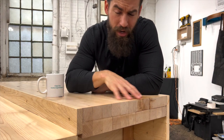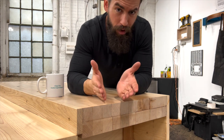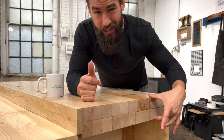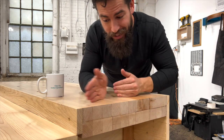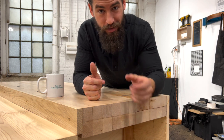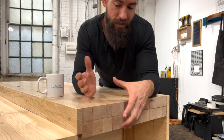The third and final joint on this bench is nothing more than a butt joint — when two boards are glued together with pressure, that's all there is to it. In this case for the top, you can see these were butted together in this orientation but also sandwiched together in this orientation, also called laminated.